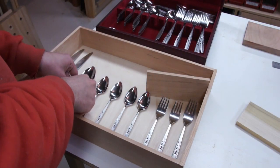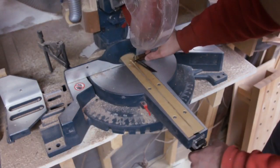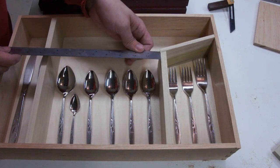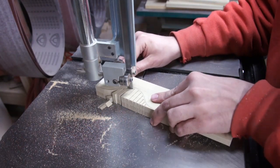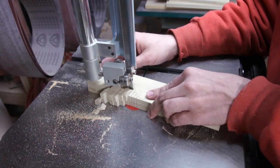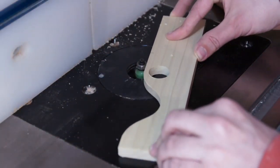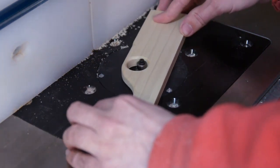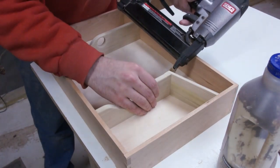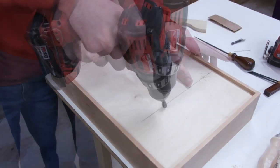For laying out the silverware, at first I had it in my head that it needed to be symmetrical somehow. Once I let go of that, I could come up with something that was just functional. I knew I wanted a couple of strips going from front to back to act as handles, but you have to keep in mind that you need to be able to reach in there and get silverware from the bottom of the tray. A lot of silverware trays have just a bar going across the middle that's notched, and the silverware fits into those notches — but that really lets them sort of flop around, making this deeper than normal. I wanted to constrain each section of the silverware at both the top and the bottom, and you would reach in at the middle.